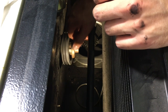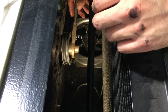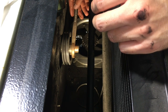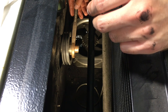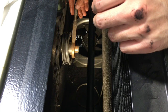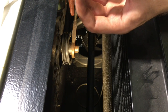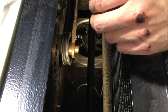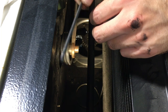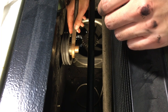So as you can see, that bushing has a split in it. And I drove this in to see if I could just slide it off with the set screw in place. And I could not slide it off with the set screw in place. But then I thought, well, maybe driving this in spread the collar apart just enough to loosen the load on the set screw, and that indeed was the case. I was able to even start backing off the set screw just with the hand Allen. The set screw really looks like it's in very good shape. I might replace it if I notice any damage, but for now it looks good.